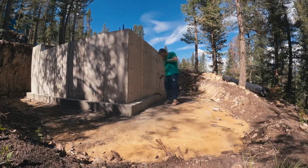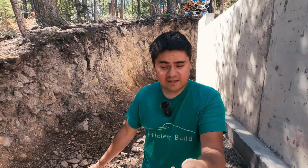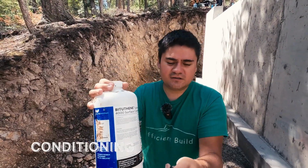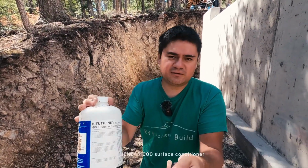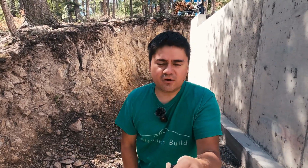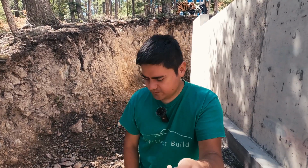The foundation surface is cleaned to an acceptable level. Then the next step is to apply the conditioner. With the conditioner, time is against us, so I need to apply it, and then we just need to wait maybe an hour, hopefully more, because the longer you wait, ideally 24 hours, the stickier it gets. But it is what it is. 1 hour is recommended minimum by the manufacturer.